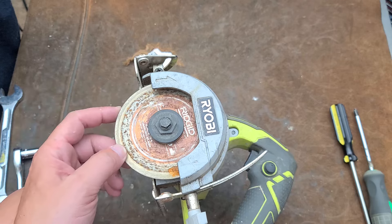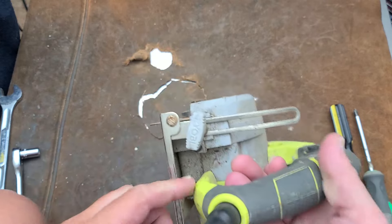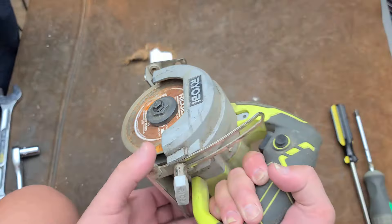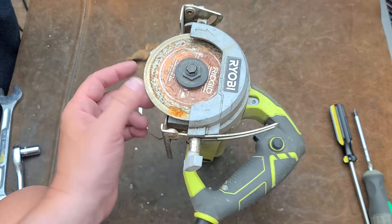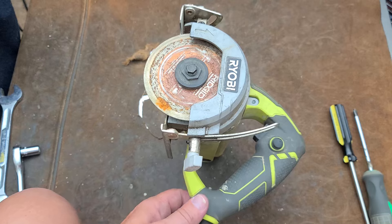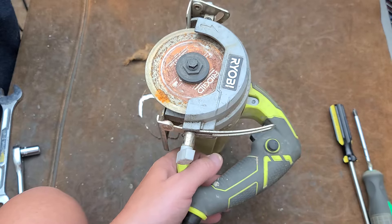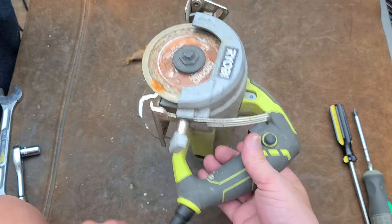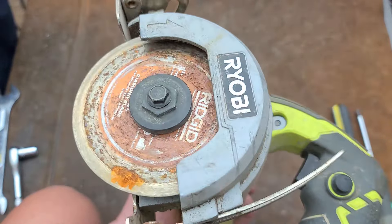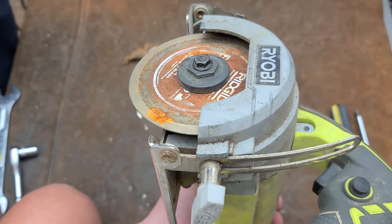Wide variety of blades. This one happened to have just a basic Home Depot Ryobi with a rigid blade. They're all wet-dry, so this had a little water system — a little plastic fork that just dribbled water on both sides of the blade. Depending on the blade, you can get turbo rim blades and that type of stuff, and specialty patterns can work real well dry. But apparently when you're cutting glass — which isn't super common — this is one of the saws you would actually use to cut larger pieces of glass. The glass slurry can build up and you really do want a wet system.